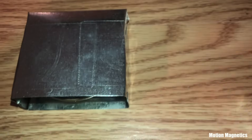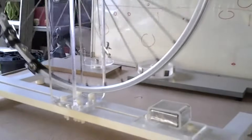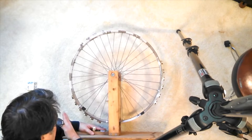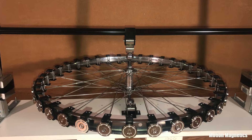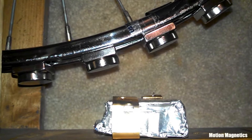The purpose of the shielding is to focus the spins of the magnets more tightly through one end of the stator while shielding the magnetic field on the opposite side so that it forms a ramp. The rotor is more attracted to the magnetic field on the front of the stator and less attracted to the metal on the back. The back is also angled away from the wheel to dissipate the attraction as it moves past the stator. This creates an imbalance that, if applied correctly, could lead to continual rotation of the wheel or rotor. The way I set up the stator magnets and rotor are not necessarily the way James would suggest building one of these systems. He usually suggests three to four stators placed around the wheel lined up at a specific angle to work best.